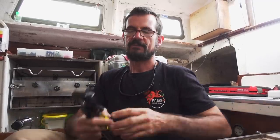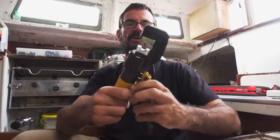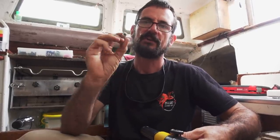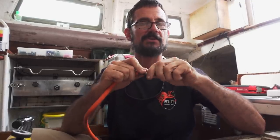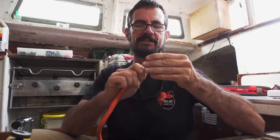I've been lucky enough to borrow a hydraulic crimper. The benefit of one of these is that when you throw a lug in the crimper, all of the forces are acting all the way around — so you get a solid core of copper right in the middle of that lug and really good contact, 100% electrically sound. When you don't have great contacts in electrical connections, those little gaps can be a source of heat — you might get sparking. In an area with lead acid batteries there might be an accumulation of hydrogen gas. We all know, since the Hindenburg disaster, what happens when you light up hydrogen.